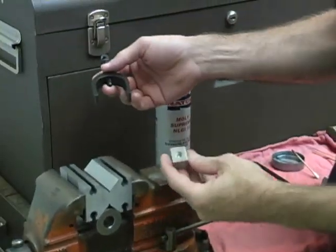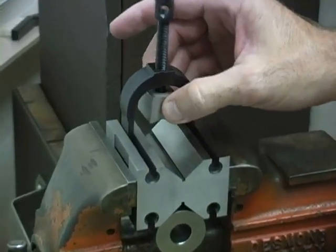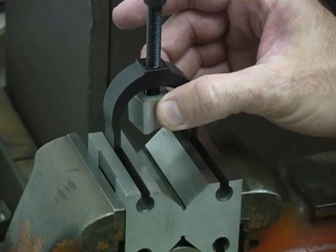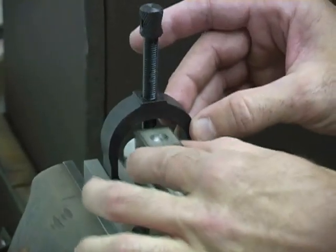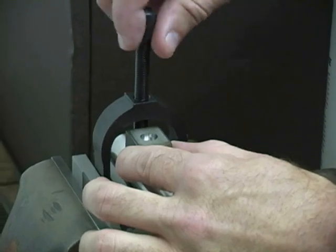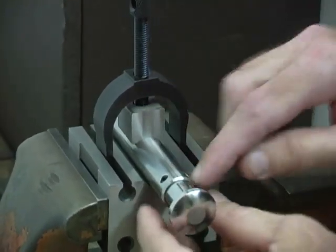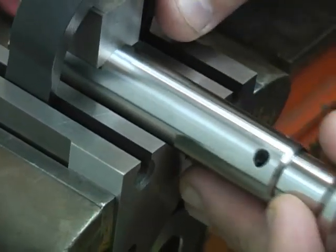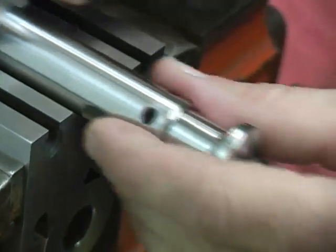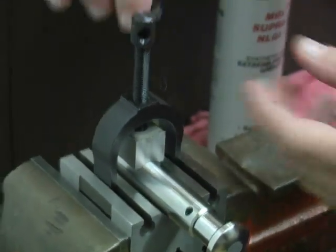We use the clamp with the punch body securing block to secure the punch. Put the punch body securing block underneath the clamp screw first, then the body can go in and out pretty easily. If you do it in a different order, the block will hit the screw and you'll have to back the screw up and down a lot. Put the pin holes about a half an inch out from the V-block — not too close, and not sticking out too far, or it'll cause torque. About a half an inch works well. Then lock down the screw with the Allen wrench.